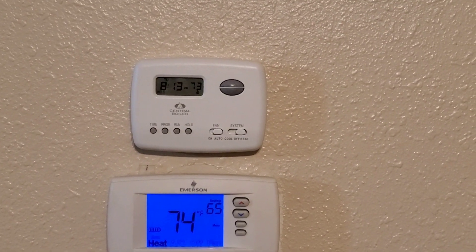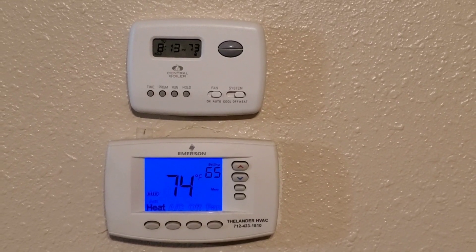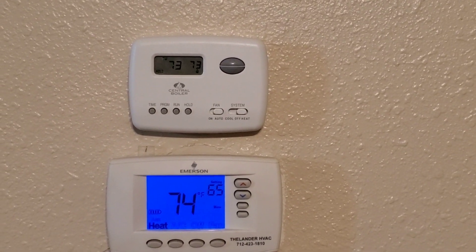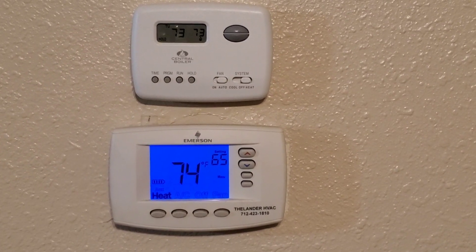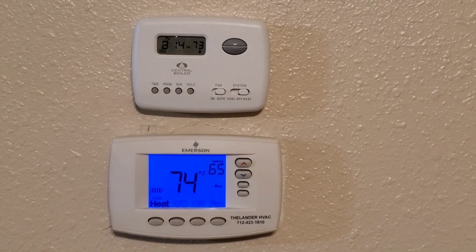It's telling you that the house is currently 73 degrees. It runs — you can't see it but it's in the wall — a jumper wire to the bottom thermostat that, if the house isn't 73 according to the top one, it tells the squirrel fan — just the squirrel fan from the all electric heat — to run. That's kind of your standard basic setup for how to run a wood boiler. Now I'll show you the pipe work in the basement.